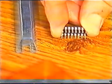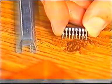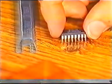When you receive chips, the legs may be bent outward slightly. You should place the chip on its side on a flat surface and press gently. This will straighten the legs so they'll fit into the sockets correctly. We discuss this procedure in more detail in the study unit about the motherboard.